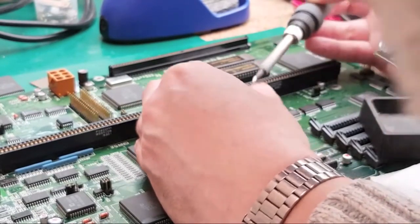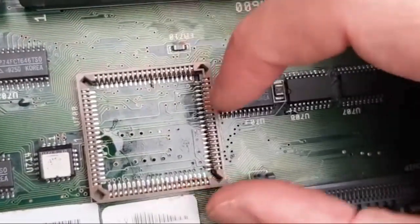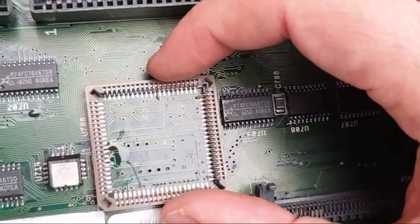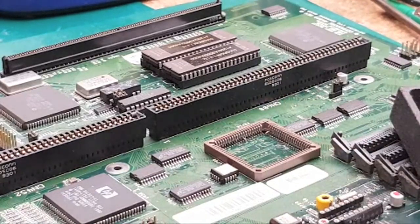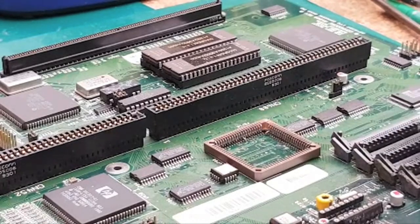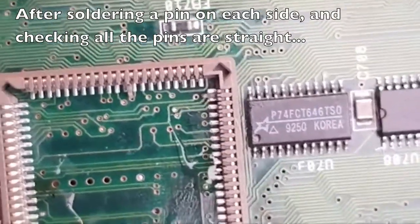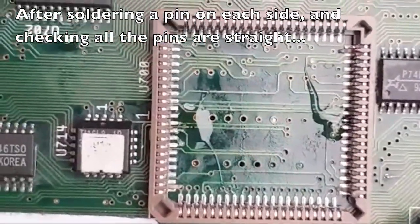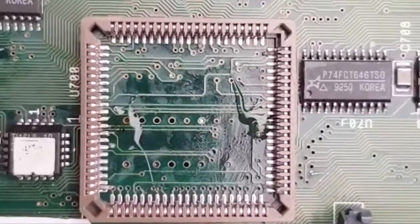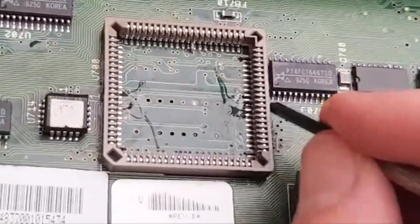I'll show you that one pin — see that, it's held on that side. So all I need to do is do the same thing on this side, perhaps a little bit more flux, and then just make sure it's totally straight and join the pin on that side — again, just a little bit of flux. Let's bring the magnification in again. You might not be able to see it but I've got a Mr. Magnifier sat over there so I can see what I'm doing. Looking at that side row and the bottom row — I think that's all right. We've got two corners anchored, and I can improve that. If I just stabilize the camera, you can see it's stable.